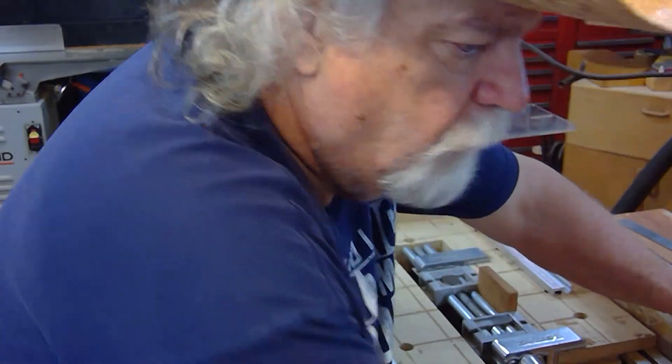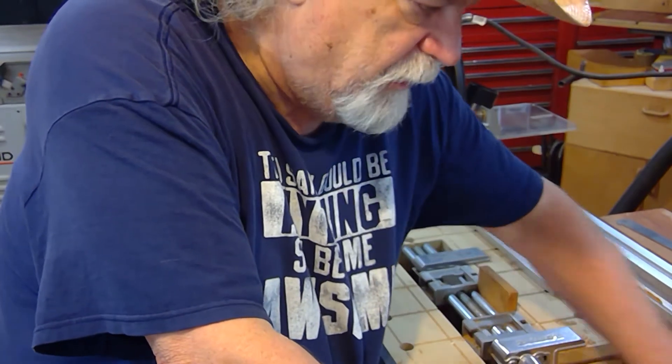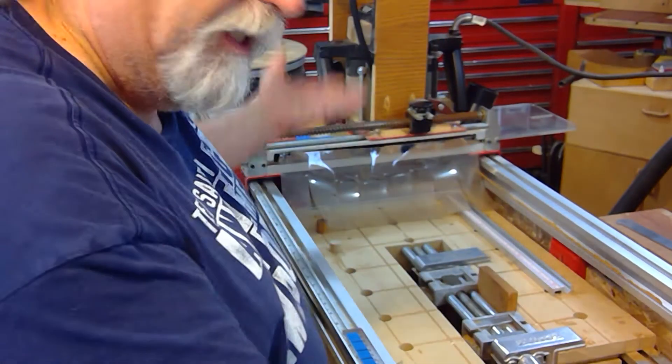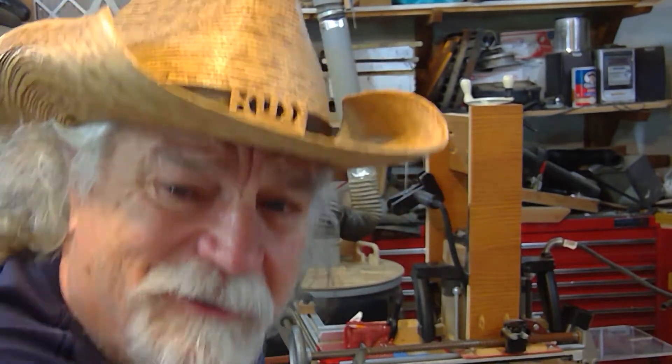The other thing I want to mention real quick is recently I did a video on setting the height of your work surface and how you use spacers — one on each end. The thing about having those spacers there is that it makes it flat from side to side perfectly every time because my board is perfectly flat, so I don't even have to think about that. When I put my board in, that helps me adjust the height on both ends. Originally I told you I was tightening up all six of my handles on this, but I realized that actually you don't have to tighten the four corner ones — gravity will hold them in place. All you really have to do is lock down the two center ones on my machine, because it's a 1200, and that's so that it won't sag. Once I set the end I lock these two down and I'm ready to go — it's a lot less work to tighten and loosen this and readjust the height.